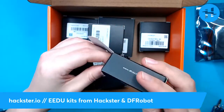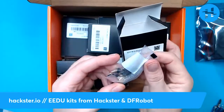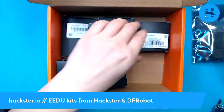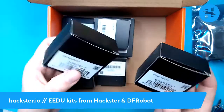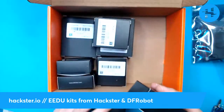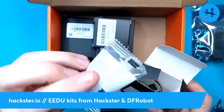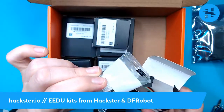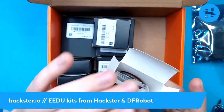If you don't want your automations to drift over time between days, you can program the RTC to make sure that your stuff stays on schedule. You don't have to approximate with Arduino loops. We have two LED buttons here — they're buttons with a white LED and a yellow LED, so illuminated buttons. Find your stuff in the dark. You can put one next to your bed and hit the button when you wake up in the night, or hit the button in the morning when your cat jumps on you and demands to be fed. All kinds of stuff you could do with that.